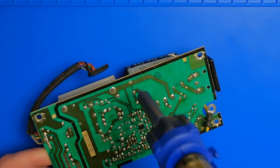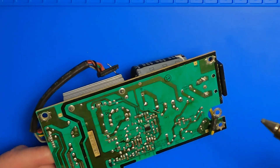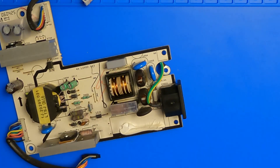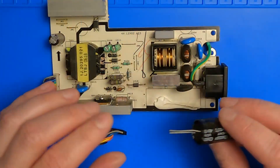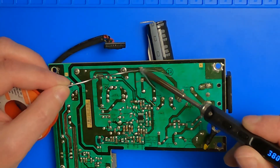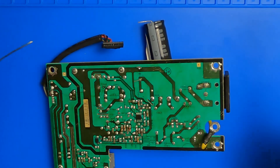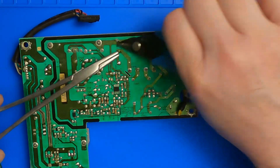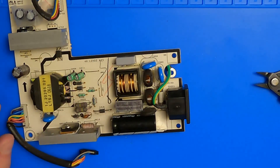Let's remove the old unbuzz capacitor — and it's quite clear why this wasn't unbuzzing anymore. Let's solder in the new one. I put in a 400 volt capacitor instead of the 450 volt of the original. It was a lot cheaper and easier to get, so we'll see. If there is magic smoke, we'll put in a 450 or higher cap. That looks wonderful.